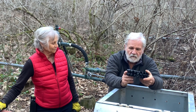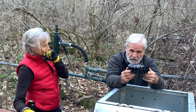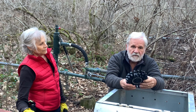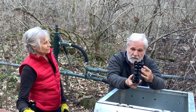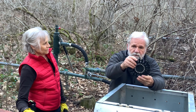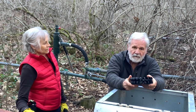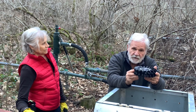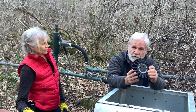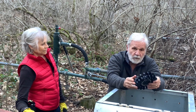The water that comes down the hill goes through a jet and spins this thing, and this is what generates the electricity. What I have to report is this thing looks just like it looked the day we put it in — no chips or dings. Chips and dings can occur when a pebble comes down the pipe under pressure and hits this and chips it. When that happens enough you lose efficiency and have to replace the wheel or at least replace the paddle. We haven't had to do that.